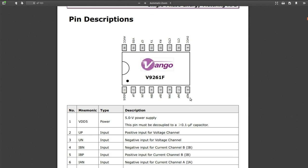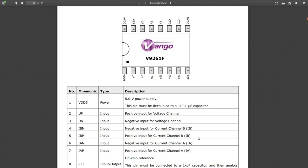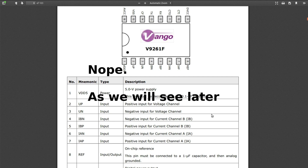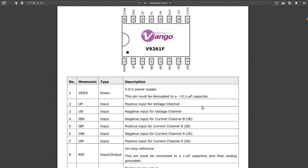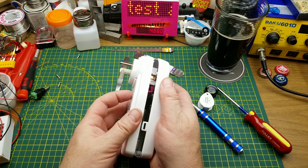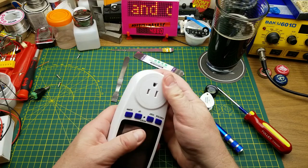Voltage RMS metering error is typically one percent, current metering typically one percent — we'll keep that in mind. Point-oh-one hertz error on frequency, which is reasonable. It can handle any of the world's power line frequencies between 40 and 70 hertz. It claims to be able to measure temperature — I haven't seen that in the menus, maybe they're not implementing it in this version. The TX and RX are used to talk to the buttons and display. There's the block diagram: current input and voltage inputs go to the ADC and into the math, compared against the internal reference.